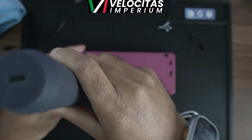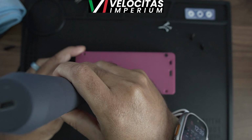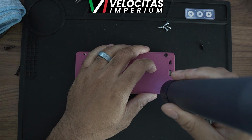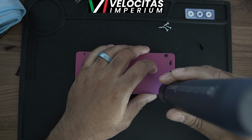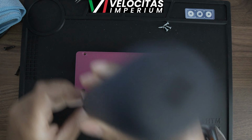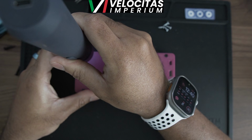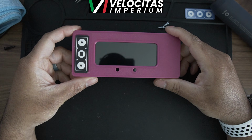All you're simply going to do now is take those M3 screws and screw them right on in. These are the countersunk hex screws, so it makes your life 10 times easier. Once you screw it in, it aligns right to the back. And like I said, because we put the screen holder down, the screen itself is not going to slide. Initially, I did not, and that led to a headache on my end. Once I flipped it over, the screen started moving. So that is essentially that.